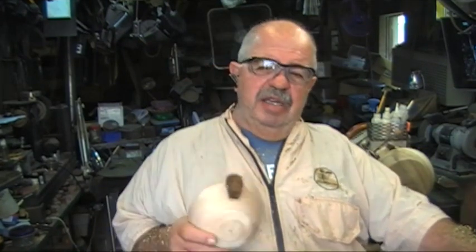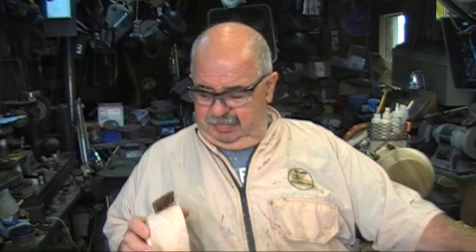If when you make the cut, it looks like it's torn, then you probably didn't make a slice. You just got wood to come off. The key to this whole thing is slice the wood away. Use that tool properly. Understand it. Number one, have it sharp. Dull tools will move wood, but not very nicely. So, in essence, I hope we spent a few moments together and I showed you how to do a little wood slicing and you can get to it and get to understand it.